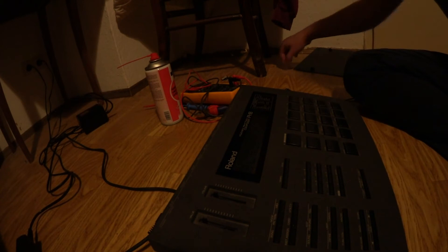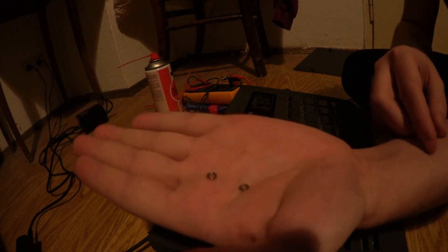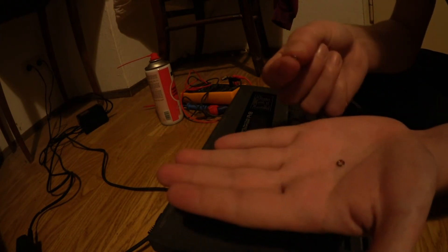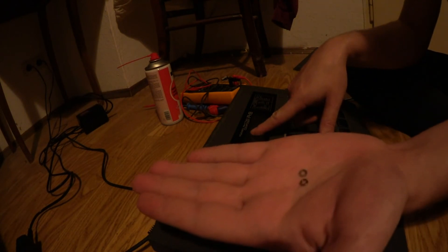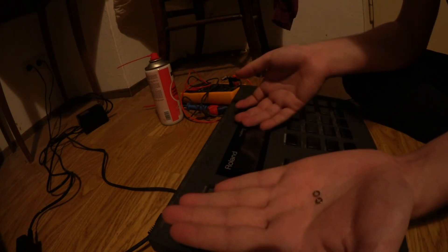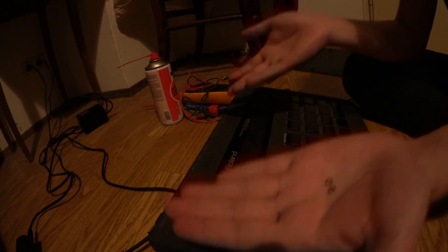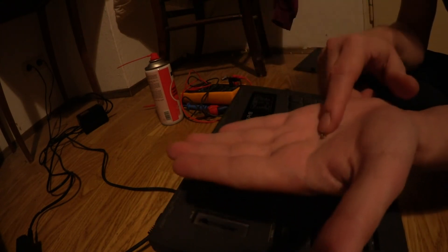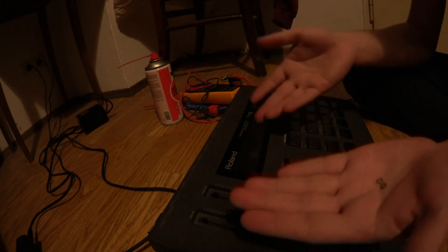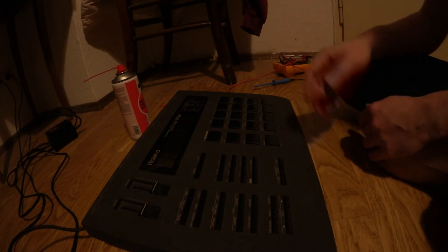There's something I found inside the cabinet — these little washers were inside there and they are made from metal. I can imagine that these metal washers were creating a short circuit on the board, and maybe that's why we didn't have our 5V at the regulator. At least it's a possibility, and I hope that was the fault, but I don't know how they got in there.